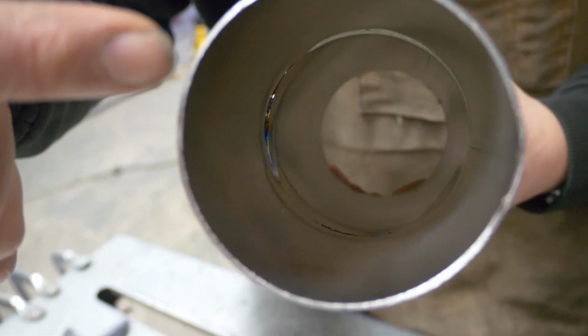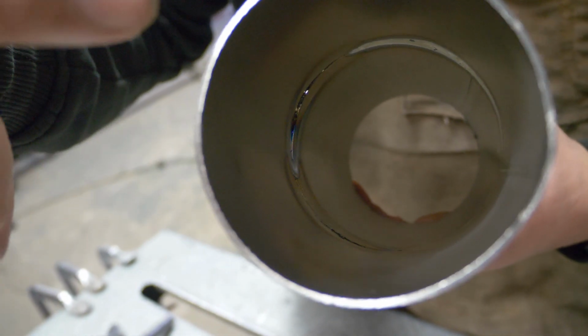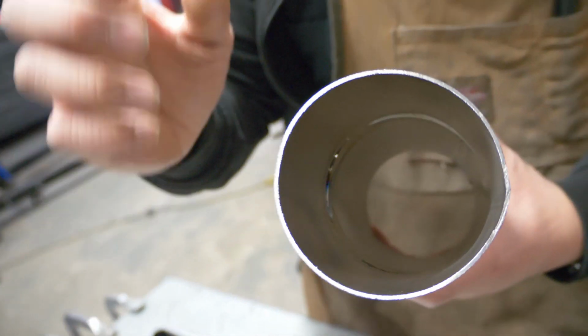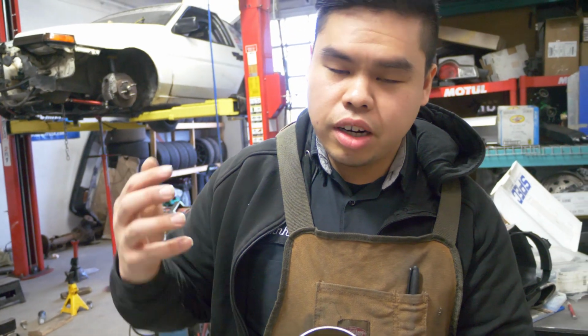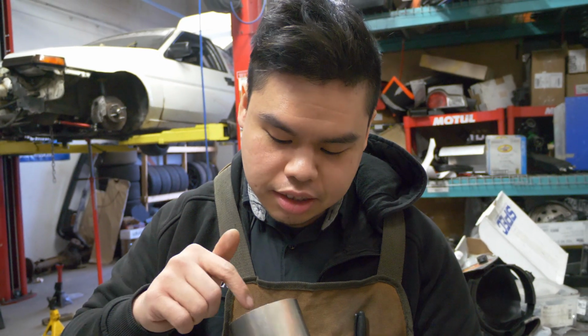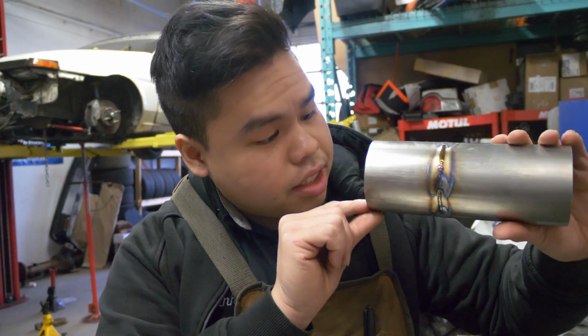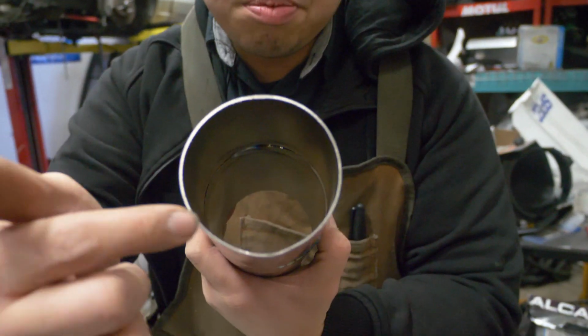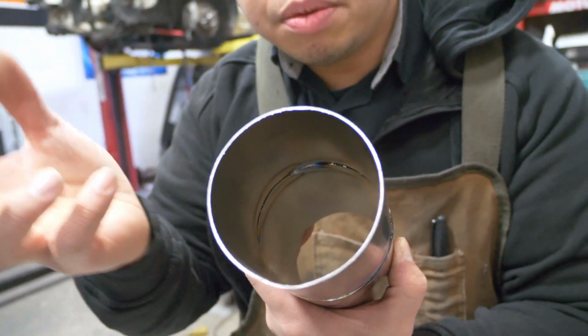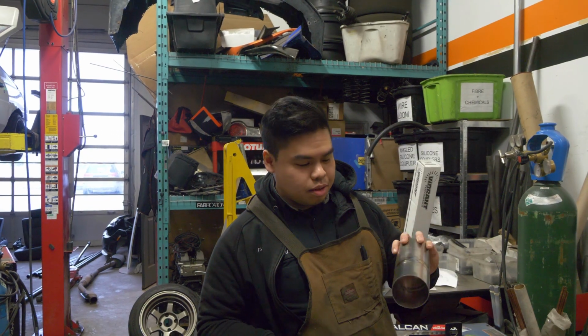When I'm talking about that yellow here, you'll see where it wasn't purged. That's when you'll see that what happens in this case is there's crystallization when you're running this through an exhaust, or this is where the exhaust, it will crack. The welds will crack because there's not full penetration here. You could see the difference, there's beads on this side, and then where there's the contamination, you'll see there are actually no beads, and you could still see where the two metals butt up together.